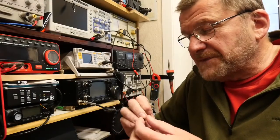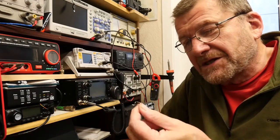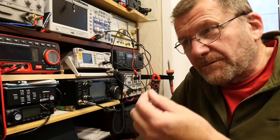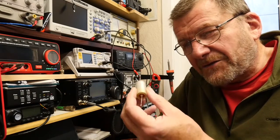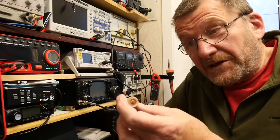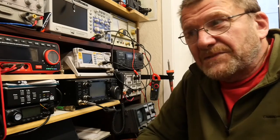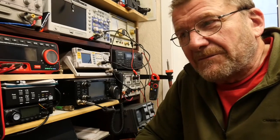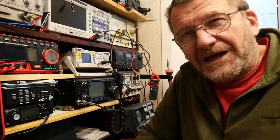I hope it's been enlightening to see what happens to these old carbon film resistors — they certainly went up by about 50% in value, so putting the correct values back into the circuit can only improve performance. And capacitors that seem to test out right from an ESR point of view can actually be failing when you get them at something approximating their working voltage — the dielectric is indeed breaking down. The PR30 preselector is a great bit of kit; they don't come up often on eBay, and hopefully it'll give me a few more years of pleasure listening with the CR70A receiver.